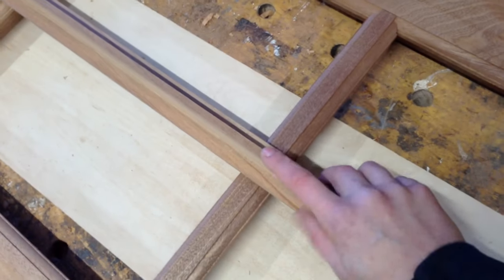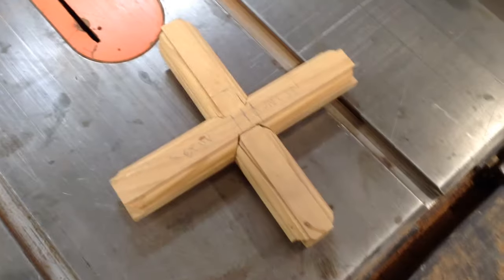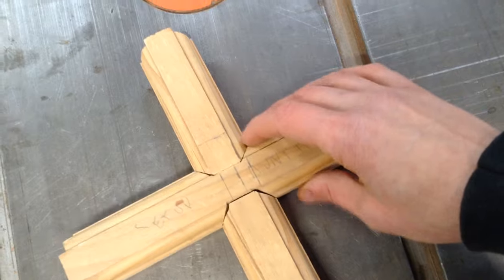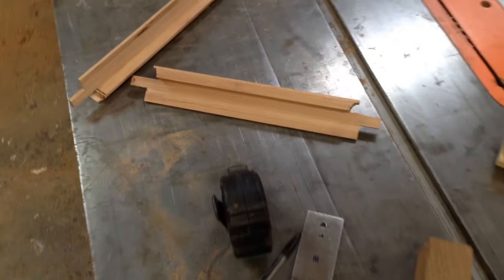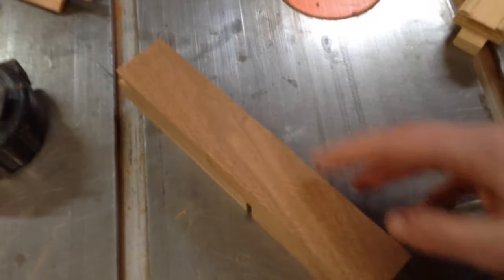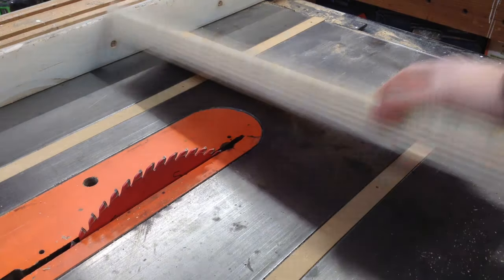This is the part that gets a little difficult — joining the vertical to the horizontals. The first thing I'm going to do is cut the horizontals because they're a little smaller and I only have to do one joint in the middle. I originally made panels like this a couple of years ago, so I had a sloppy test piece laying around. I'm changing the way I did these from years ago, and I also have two newer test pieces I cut into quite a bit to dial everything in. The main problem is that these pieces aren't symmetrical, so you can't cut all the joints with one setup.